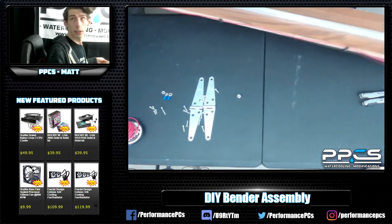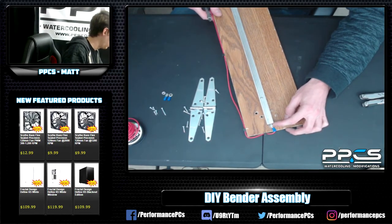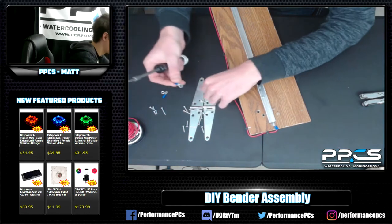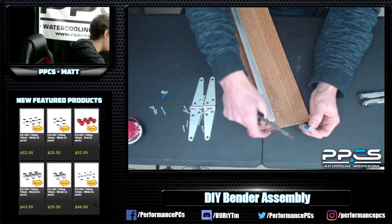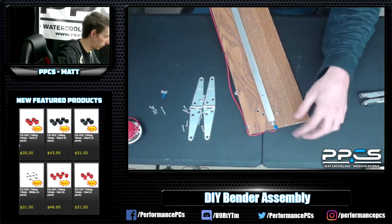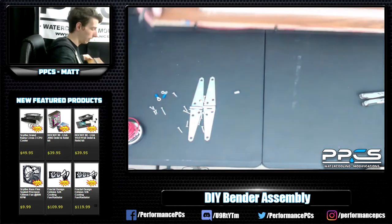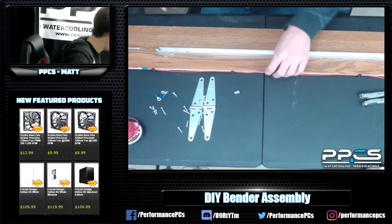For the other end here, as you can see, it's just the same kind of bolt and nut. But I have the nichrome wire wrapped around the end of the bolt, and I also have one of these little crimp-on wire ends, which the bolt goes right over. This is to complete the circuit — you need a complete circuit for this to work. This is just getting electricity from this end of the wire all the way back down to where the power supply can reach it, instead of clamping both ends. These little crimp-on ends work really nicely for that.